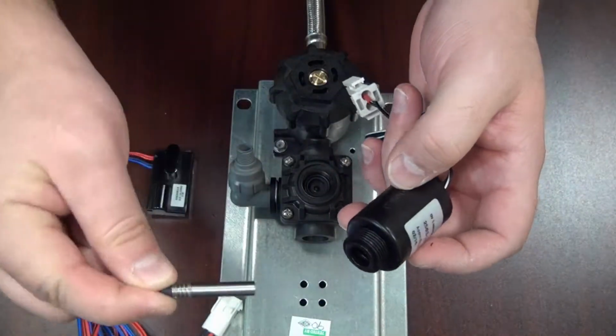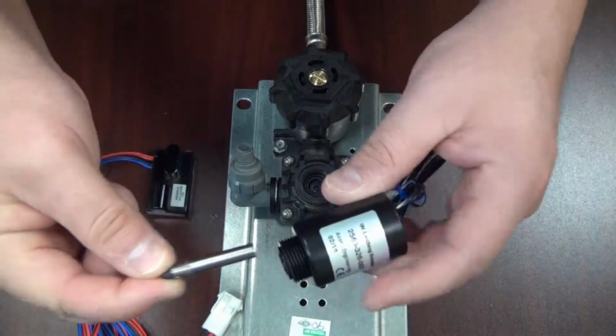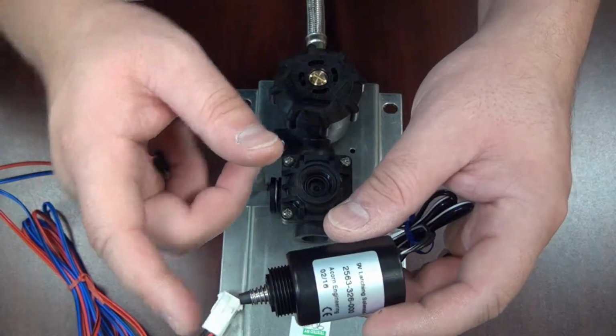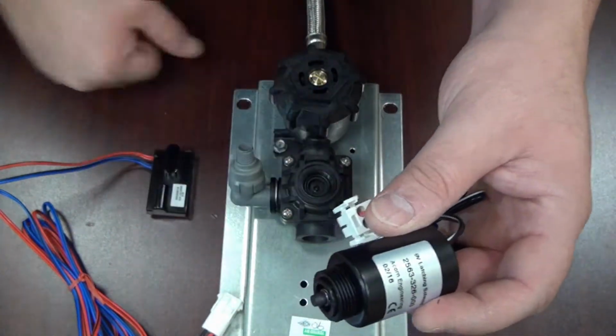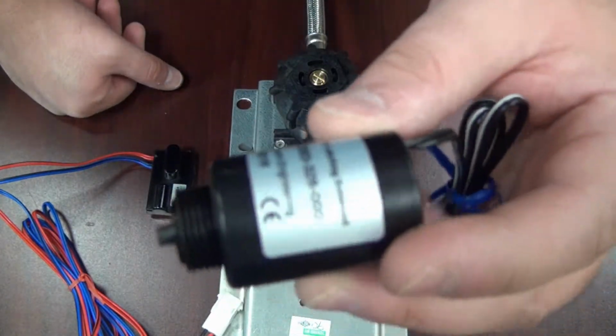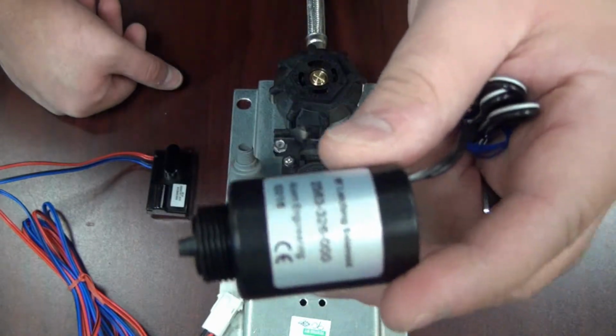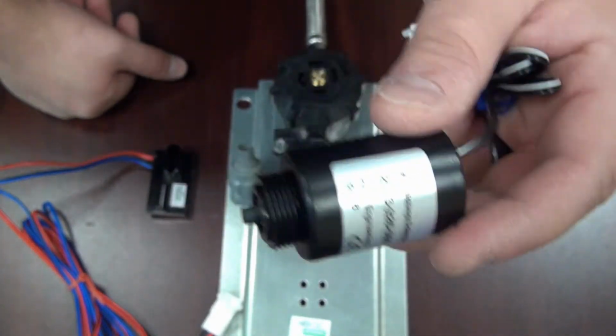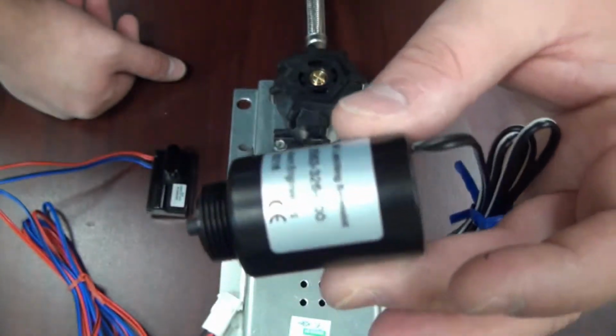When you put the plunger or piston back into the solenoid, just let the solenoid's magnet pick up the plunger on its own. Do not push it in. This allows it to be placed into the correct position. Pushing it in will place it into a current on position, and it will mimic a faucet that won't shut off.